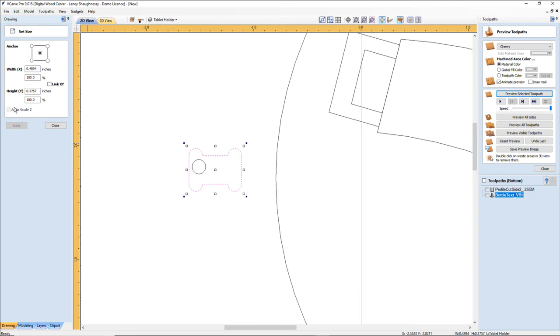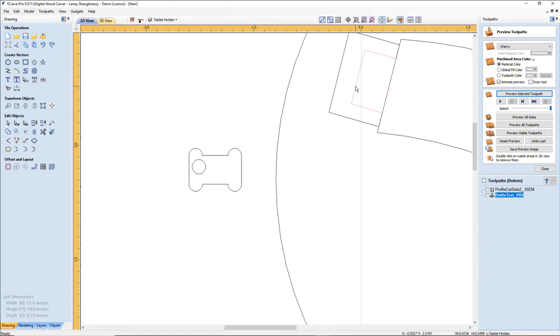We're going to make the tenon a little narrower. So instead of milling an eighth of an inch, a 16th off each side, I'm going to mill it down a little bit more. So let me undo these so I can do my, I'm still going to use my eighth inch end mill, but that will allow me to decrease the size of this slightly, just so slightly. So it's covered and hidden when I put my part in.